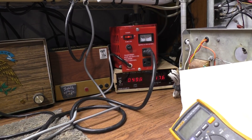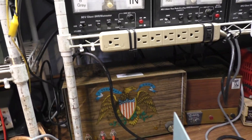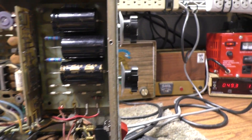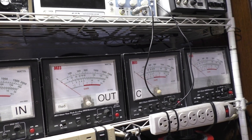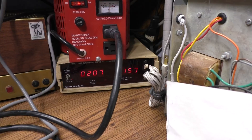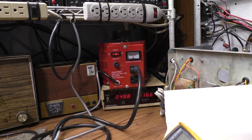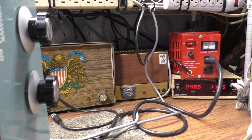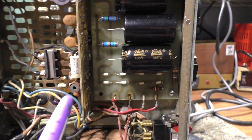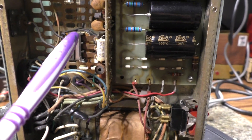If you have an inline watt meter and key down, you can check if the amp is pulling watts. Another way to tell is feeling the heat from the tubes. That little two-tube amplifier is getting hot because I keep keying it down with no watts out - those tubes are eating every watt the high voltage is producing, about 200 watts total, with 150 watts going into the tubes instead of out. Be careful - as a kid I reached too close and almost got an arc.